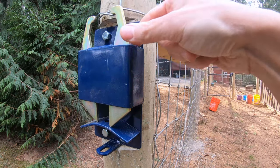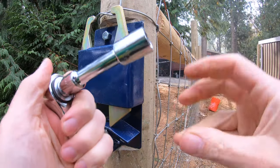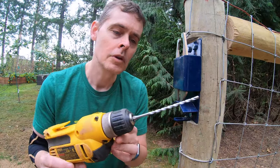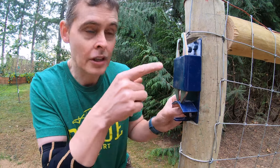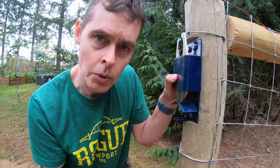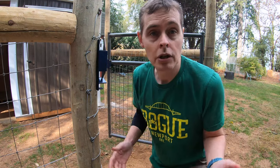I just used a handsaw to cut right above and below those pencil lines, then chiseled out between the two cuts. Because of the configuration of this latch, you'll need an extension for your socket wrench. It's also helpful to have a longer-than-normal drill bit for the pilot holes, if like me you prefer to put in one screw at a time before drilling the next pilot hole. You could just trace out the holes and very carefully drill all of the pilot holes to start with. At the end you have a very satisfying clank of a locked gate just by swinging it closed from either side.